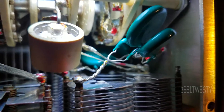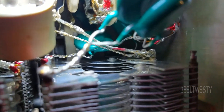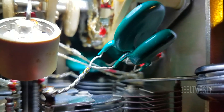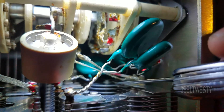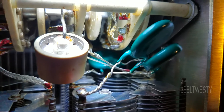There's one of them down there — right down into here. One of these tines on the variable cap was mushed together, touching the stator to the rotor.